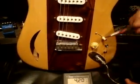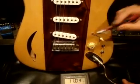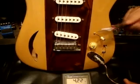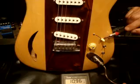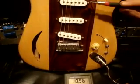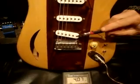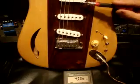We're going to go now to the position putting our bridge pickup and our middle pickup on, and we're getting a reading of 4.20. That's our 11 ohm pickup and our 6 ohm pickup put together, and we get a 4.2. Now, if we put this in the back position, we're getting our 11 ohm reading. Now this simple switch that turns on the neck pickup, we just flip that switch, and you can see now these 2 pickups are on, and we're getting a reading of 4 ohms.